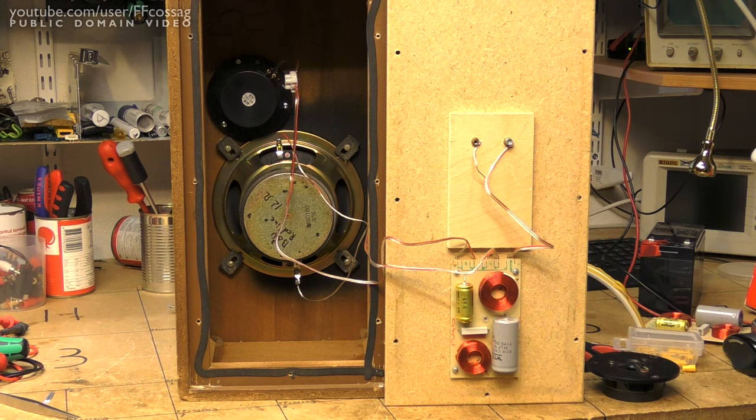I did take a measurement before opening it up, and we are seeing a very, very dark sounding speaker — a very mellowed sound with the highs rolling off many decibels below what we'd really like to see. I'm very surprised. I would not have expected such a gain in efficiency in the woofer from just doing that, since I was measuring so near-field. So I'm going to modify the crossover a bit more — I've got a couple more 10 ohm resistors which I can put in parallel with the other 10 ohm resistor, to pretty much make the tweeter twice as loud. I think that's going to work a miracle on this.